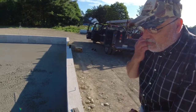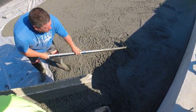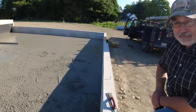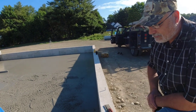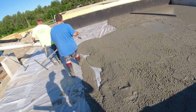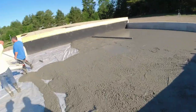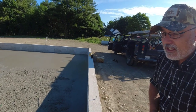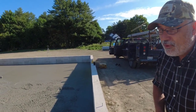Definitely not too wet, you know. That's probably close to an 8 mark. No, that ain't an 8 mark. Come on. Other loads don't do that when we pour the same slump. So you can't just keep saying that's too wet, too wet, too wet. Would you be opposed to me going up on the dosage rate? Like a quarter, maybe not a half. We can try that. Yeah, I'll have them do that.